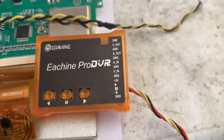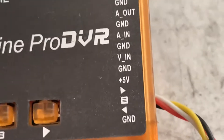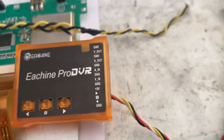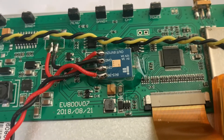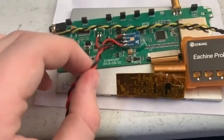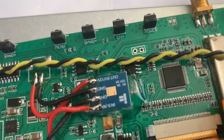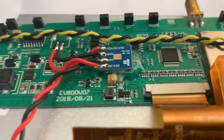The center plug also has a five-volt in. The caveat is this will only take five-volt in — if you give it more it won't turn on and you risk breaking or frying it. So what I did here is I added a Matek five-volt three-amp regulator, wired my battery power in and voltage out, and just hot-glued it to the board.